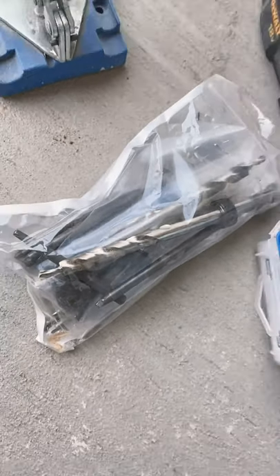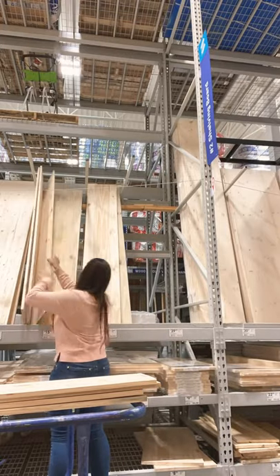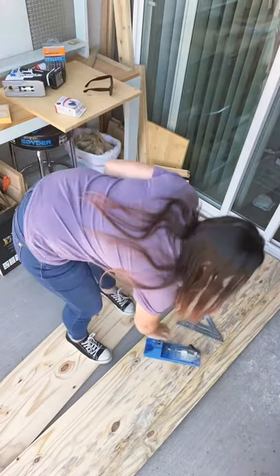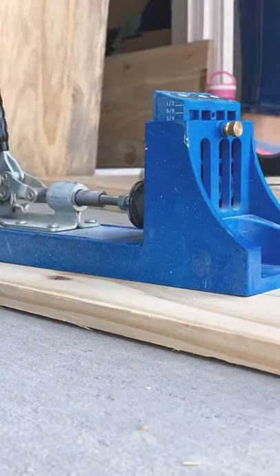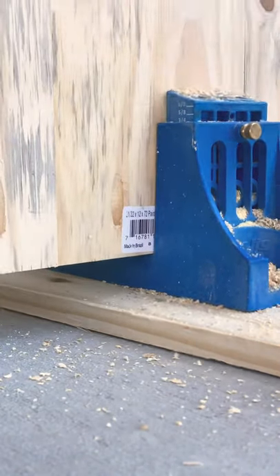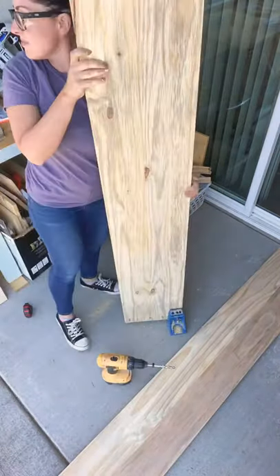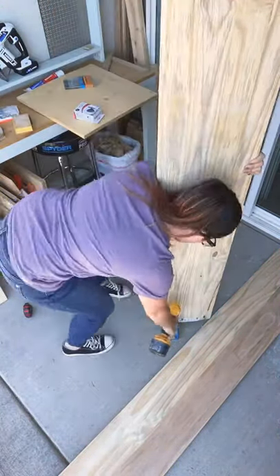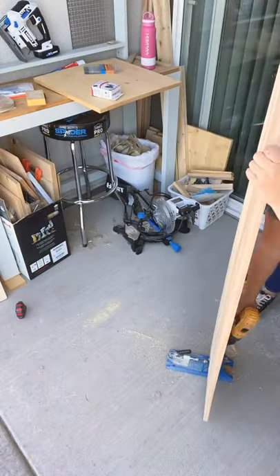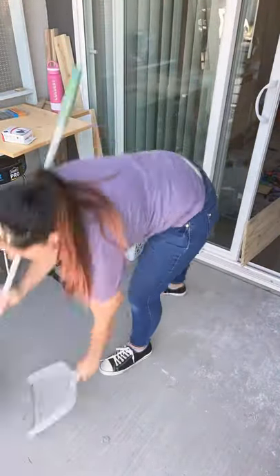You're also going to need a Kreg jig or a pocket hole system of some kind. Lowe's has some pre-cut and pre-milled lumber called project panels — they're just pine, but I thought they'd be perfect for this project. They're six feet long, 12 inches wide, and about three-quarter inches thick. Since my tiny miter saw would not be able to cross-cut across 12 inches, I decided to use them at the standard height and width they were already set to. So this washer and dryer unit will be six feet across and six feet tall. I put pocket holes at the ends of all three shelving pieces — about four pocket holes at each side. If you did need to cut across the 12 inches, you could use a circular saw or a handsaw. I would not recommend a jigsaw — they tend to not cut very straight.